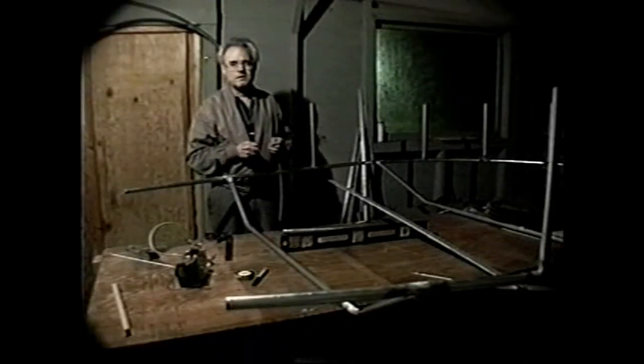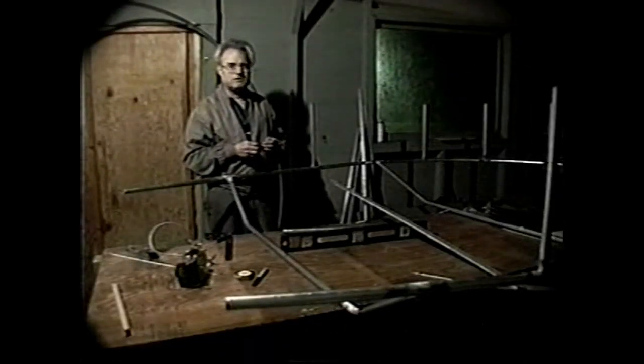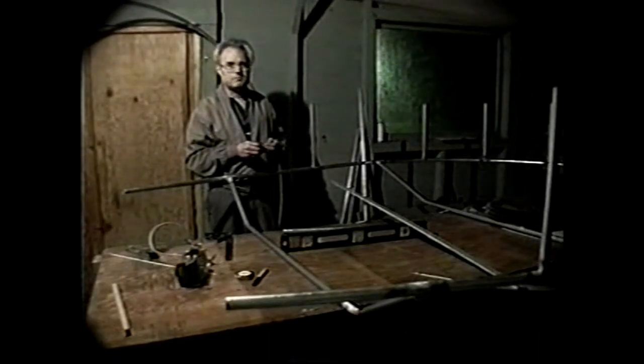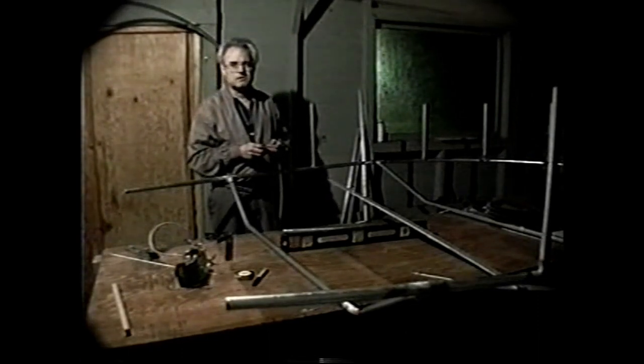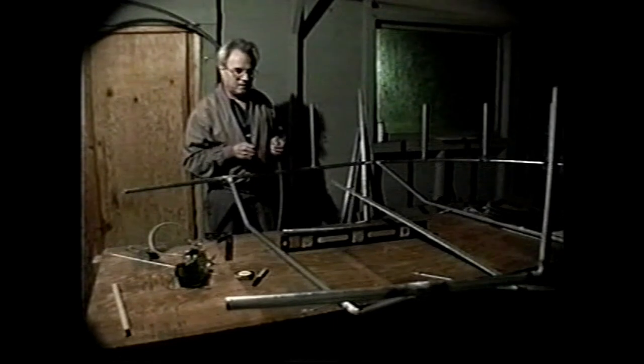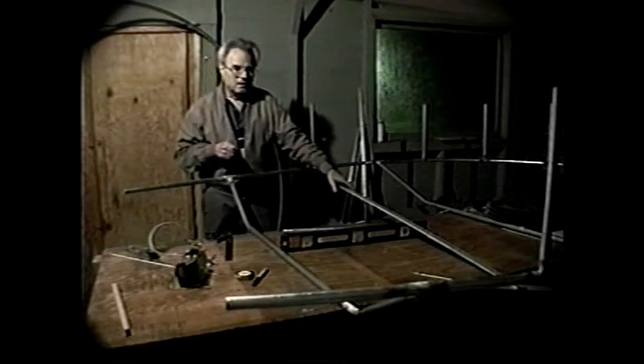Forming the hoops, the next step is to join the individual 4 assemblies that you've bent up previously into 2 hoops by joining them at the center line at the top of the guard. You should put a little doubler, which would be a piece of conduit sliced in half, maybe about 1 inch to 1.5 inches long, to make that joint extra strong, and braze that joint.